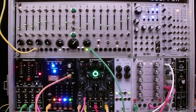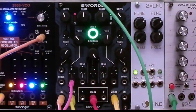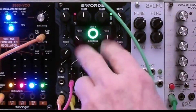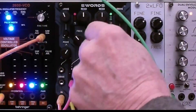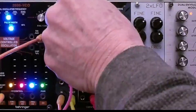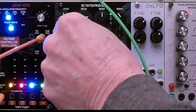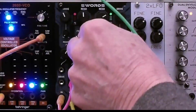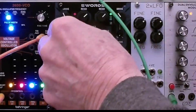There's one more common control I want to cover: the shift button. When the shift button is enabled, the LED indicates it's on, and this frequency control knob will control the center frequency of both filters. It's going to add an offset — either plus or minus — to the second filter. When you get a large amount of resonance on both filters, you can get some vocal formants going on.